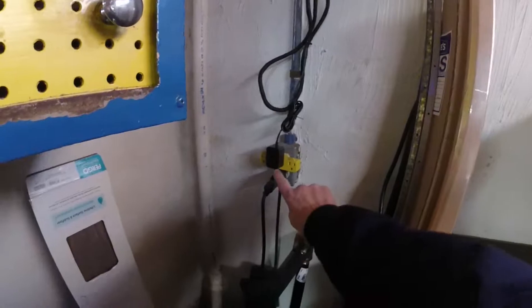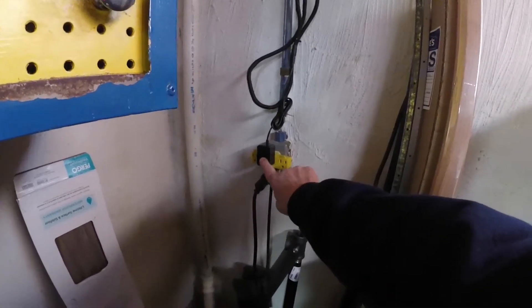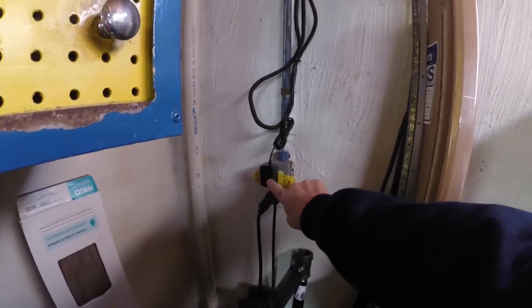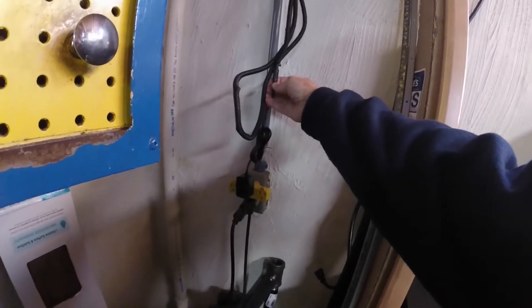The idea outside was to show you the duct, the cap, and the three-quarter inch pipe that just gets pounded into the ground. Now for the electrical side, we start at the other end of the cable where I've got a small wall wart or power supply — it's a 5-volt, 1-amp supply. It comes up here to a round connector: 5.5-millimeter diameter, outside diameter connector.